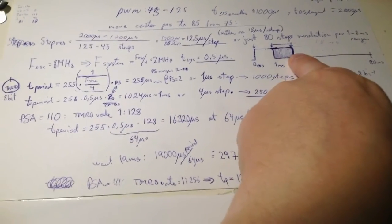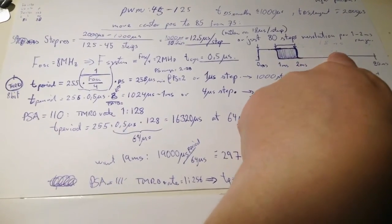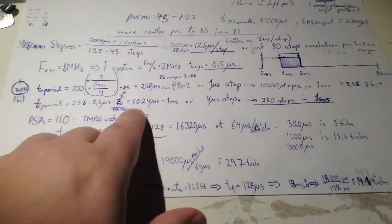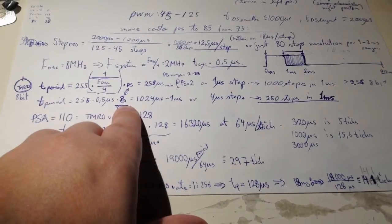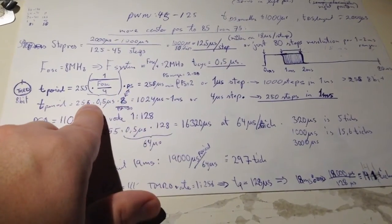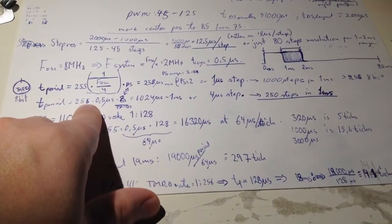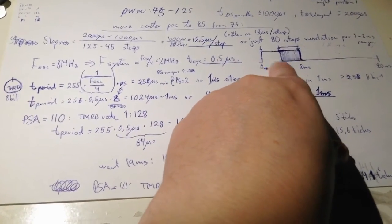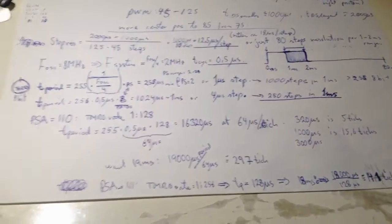So there's no interruption going on here, so the processor can run freely. And then the voltage on the output is set to high. And then I set the prescaler back to 8, and then this value here to, I think, 250. We'll have a look at that to get sort of the fixed period here.